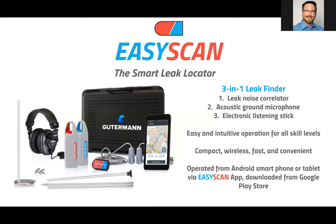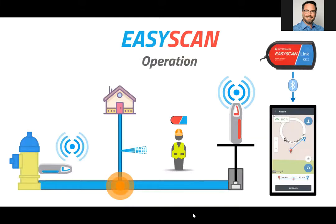All right, let's take a look at the details of this kit. The EasyScan kit is a leak correlator that pinpoints precisely the location of the leak along a length of pipe. These sensors are very flexible as far as how they can be positioned and where they can be placed upon the pipe network. It's a magnetic connection, and all the operator needs to do is find an access point on the pipeline, positioning the leak in between the two sensors.